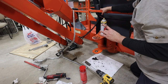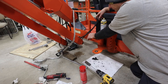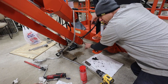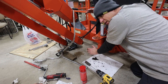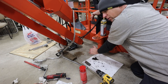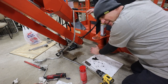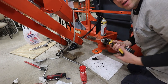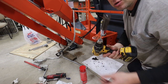But long story short, there's no grease in any of these composite bearings. And this connection here has just got a bolt. This connection does not rotate, so it rusts. And then the pin is hard to get out. So I had to make a custom press that I could stick a little 4-ton hydraulic jack in, and I was able to get the pin out, but it was not something I wanted to do outside when it was negative 20.